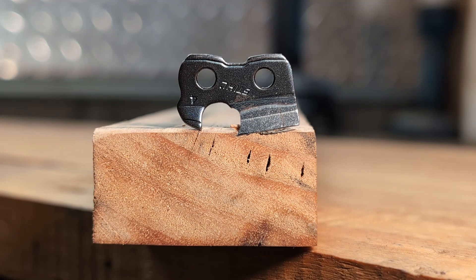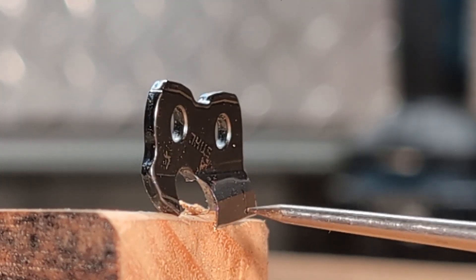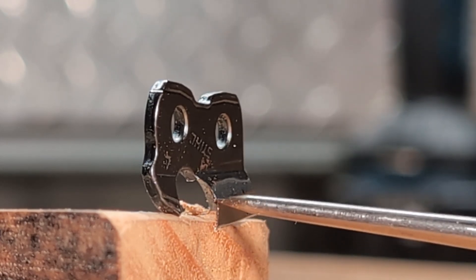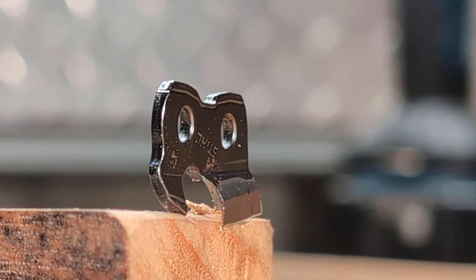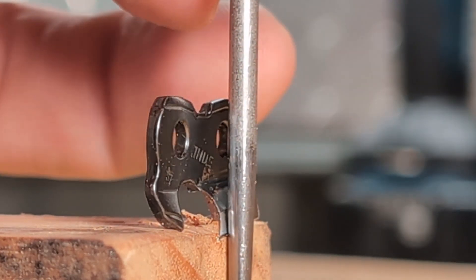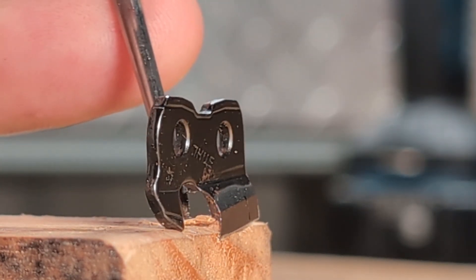Here we have it from more of a side-on angle. You can see how things are working - our leading edge is in there. The angles that were formed on the inside start to deflect the timber, the wood chip, across to the inner edge. You can also see how little of that side plate is engaged from this angle. The cutter isn't all that wide - the widest point is the outer edge of that corner - so very little of it makes contact with the wood. That's its side plate clearance angle.